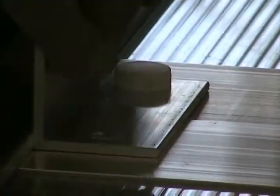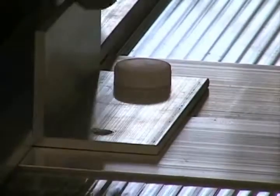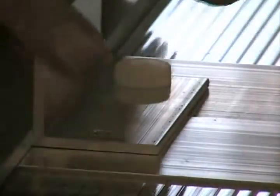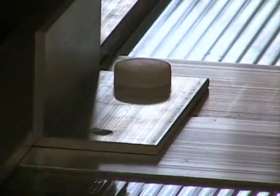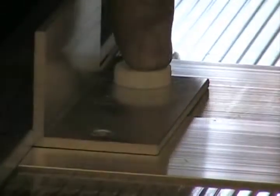What we're doing here is we're assembling the door handle on. You'll position this approximately center in the middle of your doors. Using the 5/8 screw and the screw cap, we put these in using a drill. And you can see that once they're in position, you just close over the top of the cap and it seals it away.